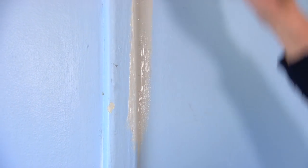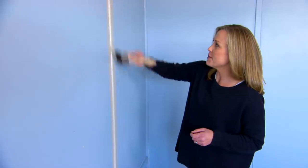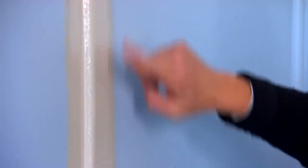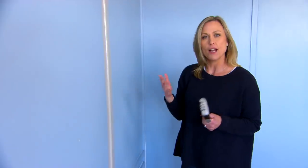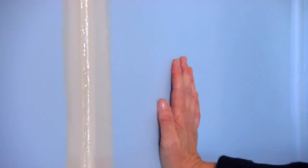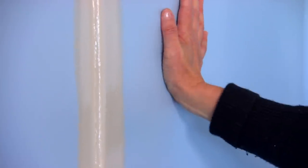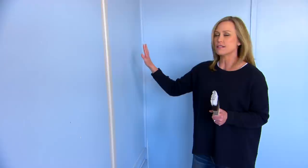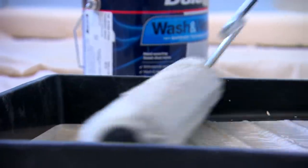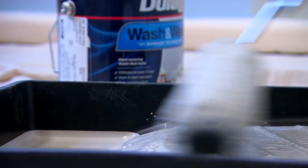For trims, vivid white will be perfect. Cabins of this vintage were often made from pretty simple materials like asbestos. These cover strips are often a giveaway. A quick way to check is to get your hand in between each panel — just push, and if it flexes it's more than likely masonite; if it doesn't flex it's more than likely asbestos. So if you suspect it's asbestos, do the checks before you drill in the wall — that way everyone can be safe.